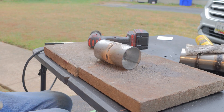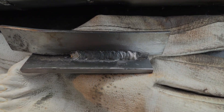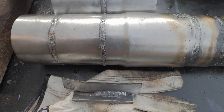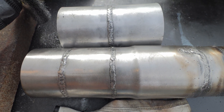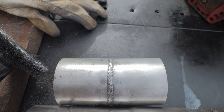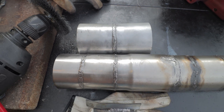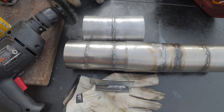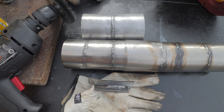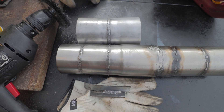Let's clean her up. Okay, so here we have three different materials and three totally different outcomes. The thicker stuff is definitely way easier to make look nicer. Stainless definitely conducts heat differently — the same settings will blow right through it. And then you have mild steel, which was definitely the easiest of the exhaust pipe to weld. You can put the heat on a lot longer, go slower, and control it a little better. Hopefully this has been helpful — I wanted to show the three different materials just to illustrate three different scenarios you might go through, because the settings are not the same and the materials do not act the same. Until next time, don't forget to subscribe, hit below if you have more questions, and peace.